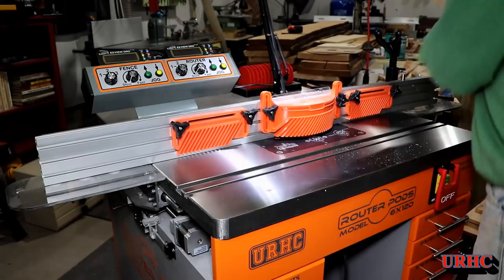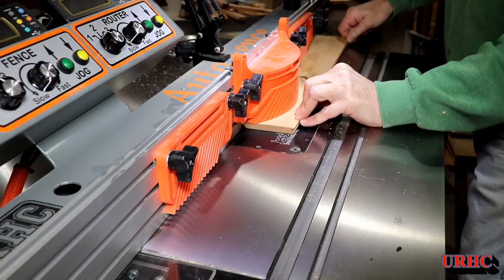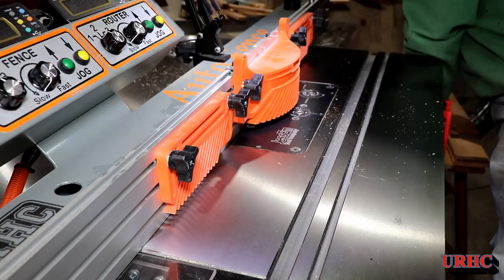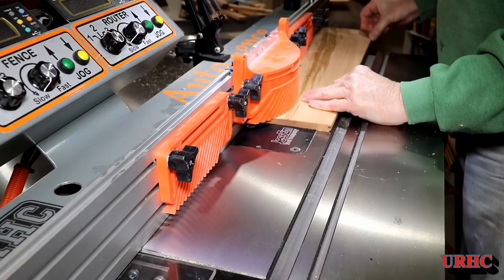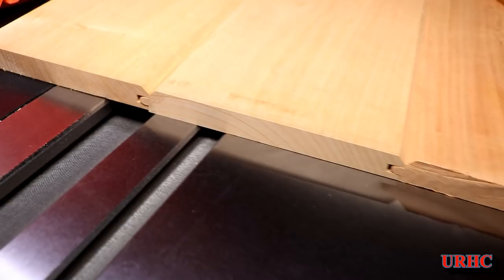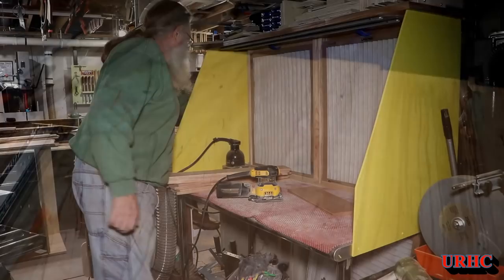Just a matter of running them all through. I get a nice cut with that MLCS tongue-and-groove cutter set that I bought a while ago. It's really so easy to make this kind of stock, and it would cost a fortune to buy it — plus you'd never find it in wild cherry. Only took a couple of minutes to run all the pieces. You can see the side pieces match at the top — everything came out perfect and aligns perfectly. The pieces off the top are going to do a great match going around the side.